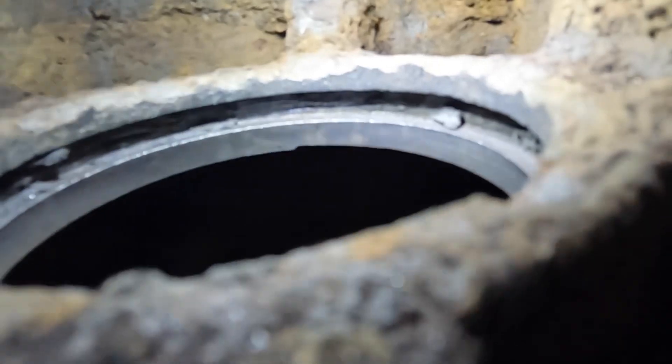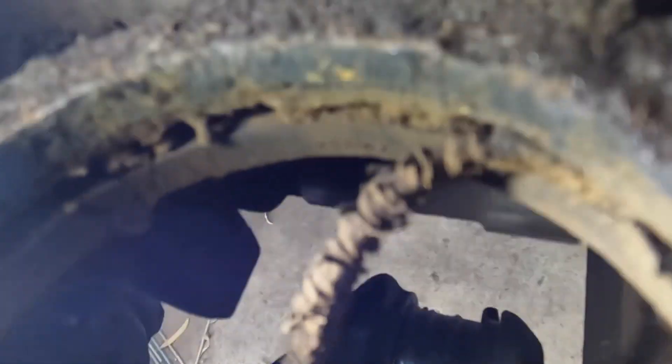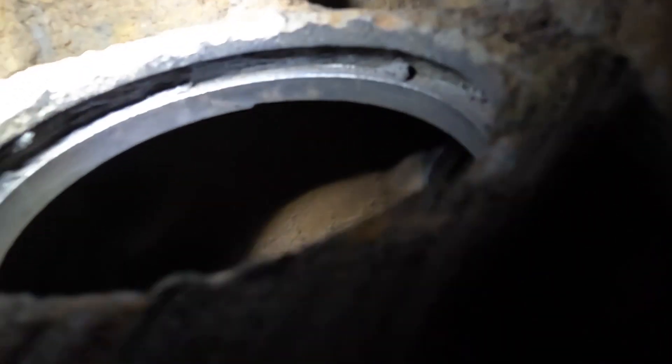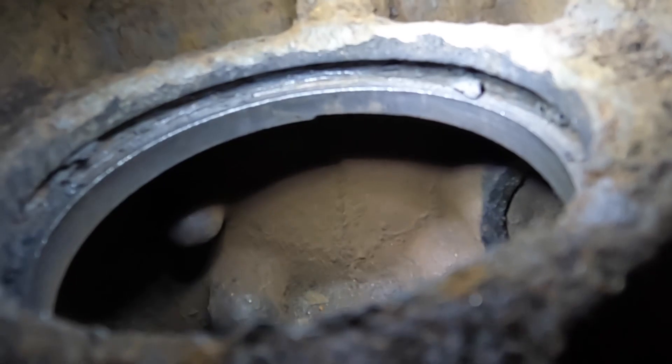We can just see the o-ring groove in here. Now the old o-rings — you can see there's one o-ring in this cylinder next to it — they're in really poor condition and they're really thoroughly stuck into the recess. I have managed to dig one out of this side but there are still a couple of bits of it stuck in there, and we need to make sure this is really, really clean before we start reassembling the block.